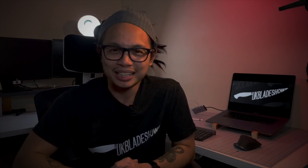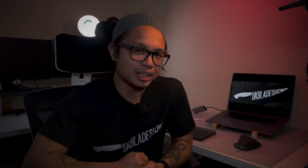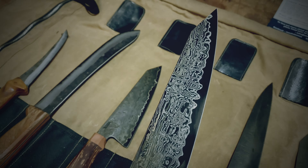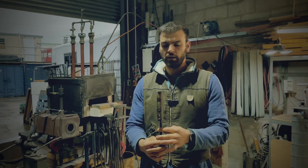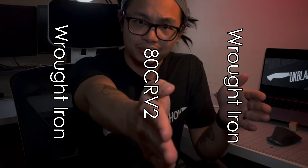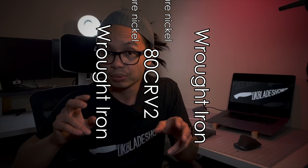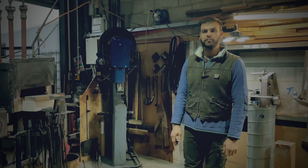Hi, this is Vince from the UK Blade Show, and today we're going to be shooting with Constantinos of Nuko Knives. So what are we doing today? Today we're going to be doing a Santoku, and to start with we're actually going to be forge-welding it from raw steel. We're going to have three different types: some raw iron right at the edges of each side, 80CrV2 in the middle, and some pure nickel as well. We're going to put that in what Constantinos calls a sacrificial furnace because of all the borax falling left, right, and center. If you watch the video all the way until the end, he's going to show you what it looks like when it's properly forge welded together, so make sure you stay until the end.